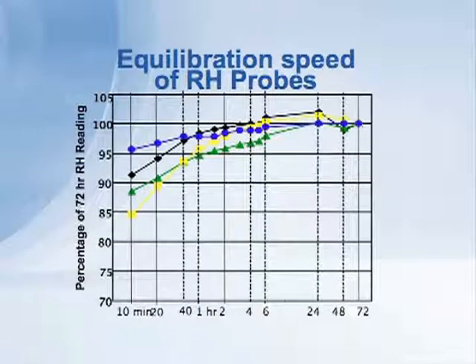This graph indicates the results we made with several different brands of relative humidity probes, all meeting ASTM F2170. On the vertical left-hand axis of the graph, we see the percentage of the final reading with the probe — that is, we put probes into the concrete and it took so many minutes or hours for them to eventually come to a final reading. We did this over the course of up to three days. The bottom axis of the graph is logarithmic.